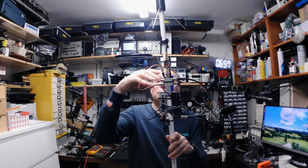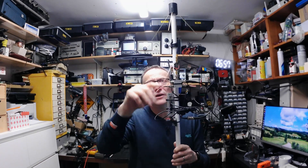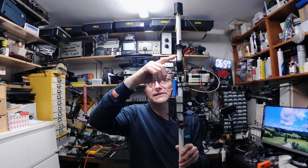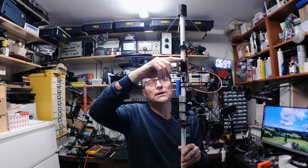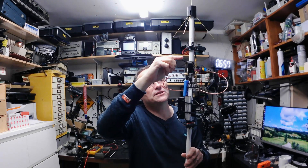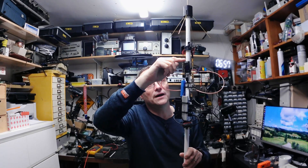Because we're going to feed it into this also AliExpress passive splitter. It's got four outputs, three of which we're using. One feeds this LilyGo board — that's a sort of PAX counter kind of board with a LoRa transceiver on it. It's not transmitting in this instance, it's just receiving.